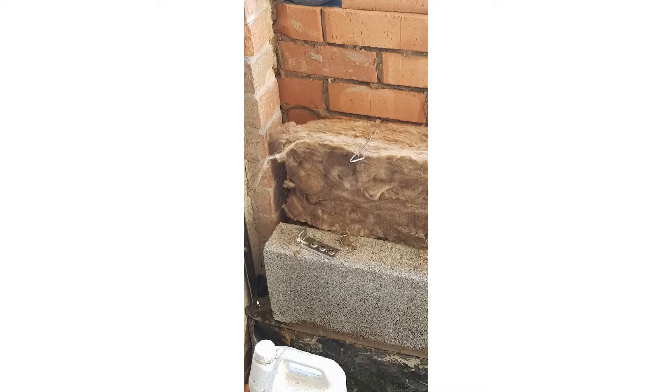Going down here there are wall ties — these are drilled into the inner wall and the inner wall is tied into the existing brickwork using little metal brackets that go from the wall into the mortar joint of the new wall. You can see them putting insulation in the cavity. Here you can see the drain at the front — I later had to take some material off the drive to be able to get the drains back in, which was a bit of a pain. These are the tying brackets going into the mortar joint, tying in the new brickwork with standard ties.